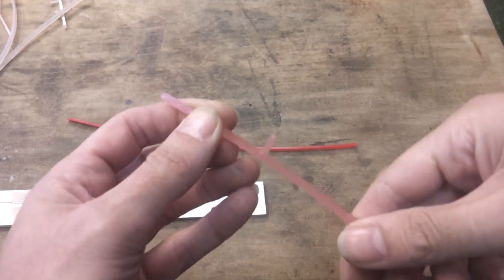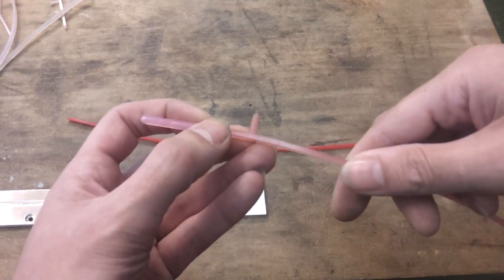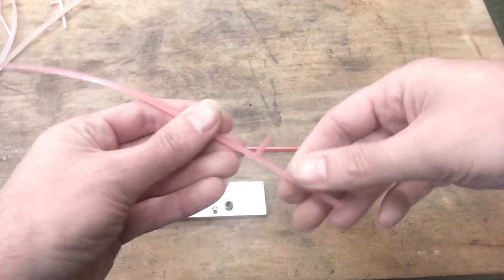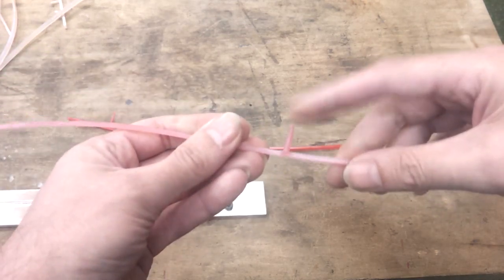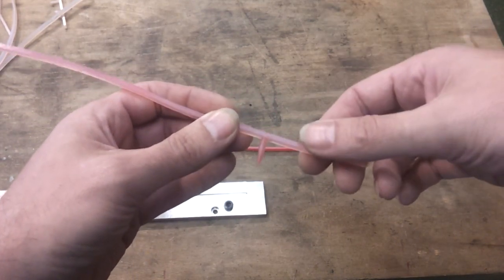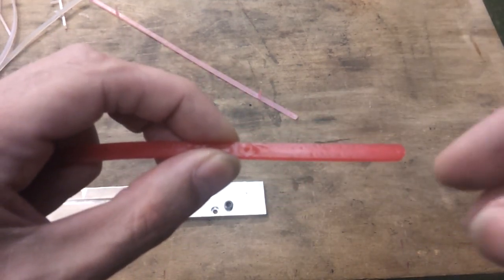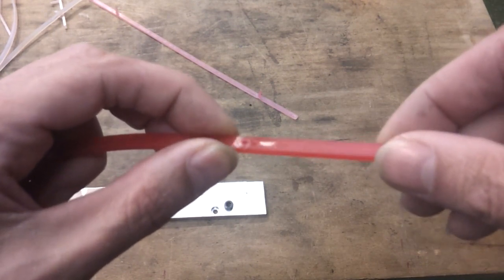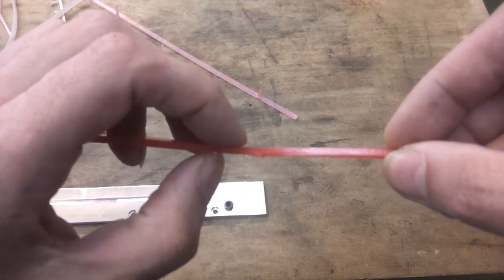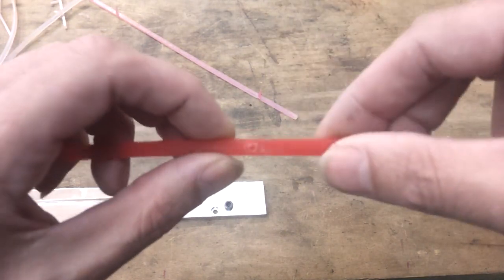What we're getting at the moment is quite a long sprue from the gate — about 3.5mm wide, maybe 10-12mm long — and that's obviously enough to get a purchase on the part and pull it off onto the fixed half. You might be wondering why I don't just put those sprues on the other side to make grab pins, but the problem is that occasionally they break off. When that happens on the feed side it's not too much of a problem because the next cycle will blow it out, but if that was a grab pin on the cavity side, that hole would be filled in and it's not going to work anymore.